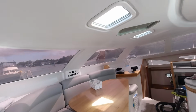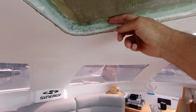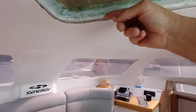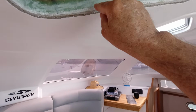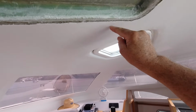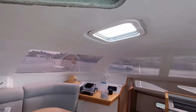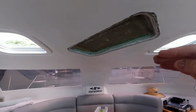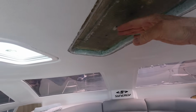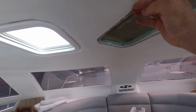Okay, just had a big clean up, and I've just green trimmed the edge of this. Now this is basically consolidated down and tied in. I've actually done 4 layers on here, which didn't even need it, and then probably another 8 subsequent layers to laminate it into the foam. The last thing I need to do is laminate from here to the edge. I'm going to increase this margin all the way around so I get a really nice textured edge, which will blend in with the rest of the boat and hide this once we put in the plush liner that's going to go on top. So the stainless steel will go, then there'll be 4 or 5 nuts holding that organiser in place. And yeah, that's pretty good.